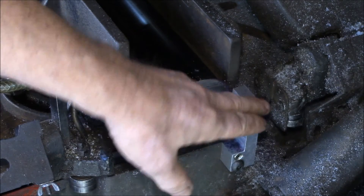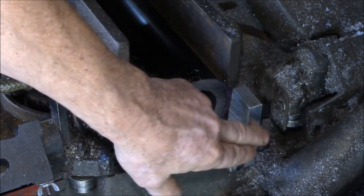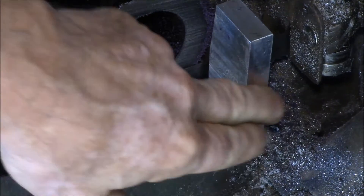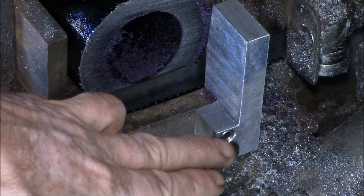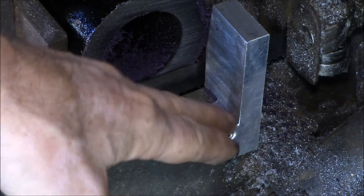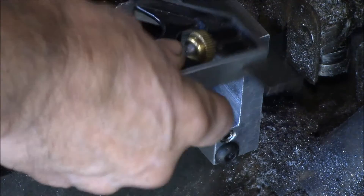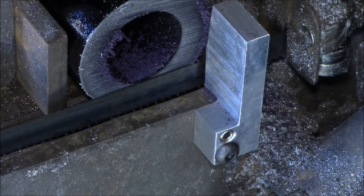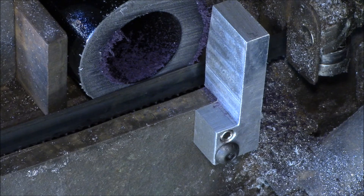This is a handy little gadget if you're cutting anything polyurethane, rubber, or anything that's kind of flexible — it provides a little support beyond the blade. It's just a one-inch piece of aluminum; I left a tab on the bottom with one eight-millimeter screw that goes in with a head on it, and then a little set screw inside the upper hole to hold it vertical. Then I just started whittling away at this face, kept installing it, and used a straight edge across the vise to the face of that piece. You pretty much get one chance to make the right offset — if you cut too much you have to throw it away and start over, so you have to whittle it down and keep measuring to get a nice flat surface.